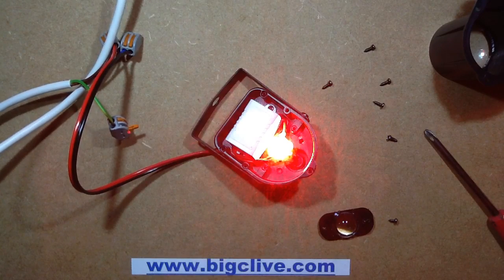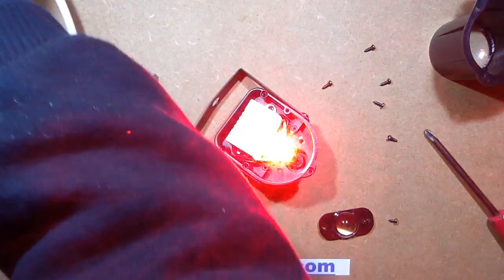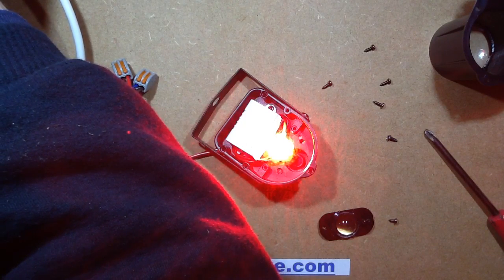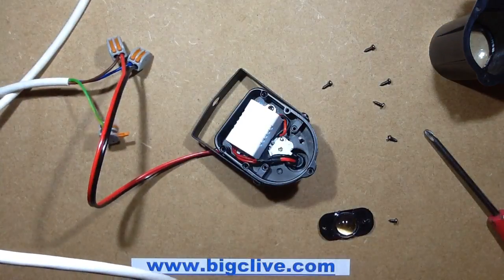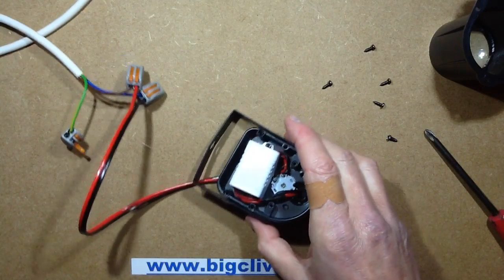Oh, that's bright! The red LED has lit. Let's plug it into the power meter — 2.7 watts. So that really looks like it's a 3-watt driver, and the lower forward voltage of a red LED is making it draw 2.7 watts, not 3 to 5 watts as stated on the packaging. But not to worry.